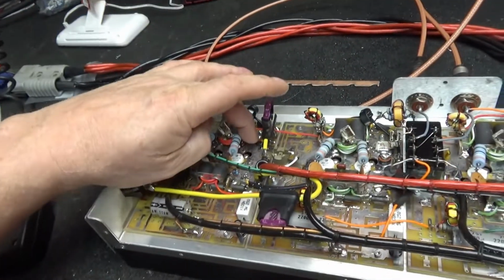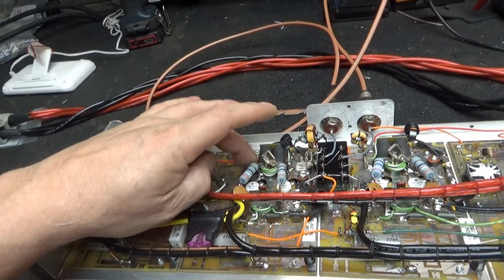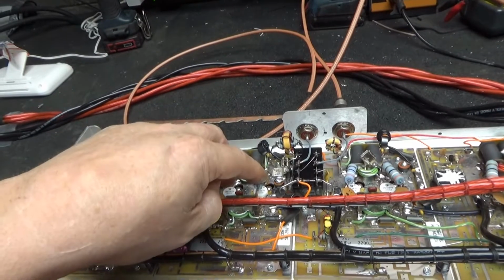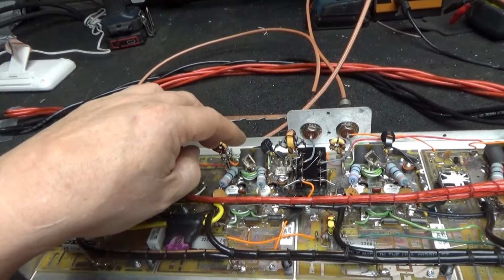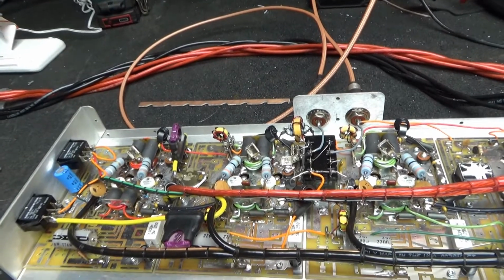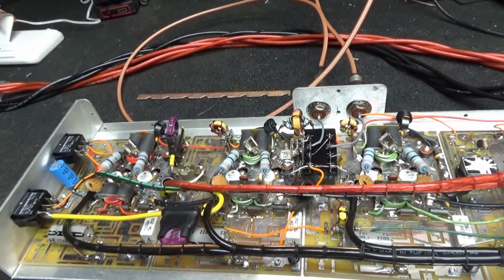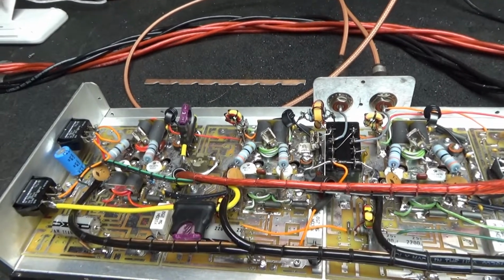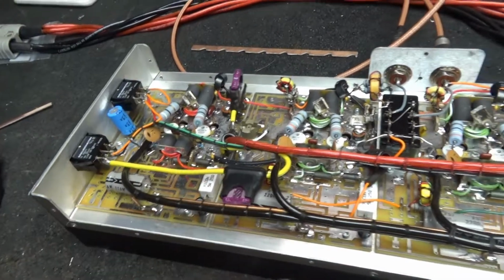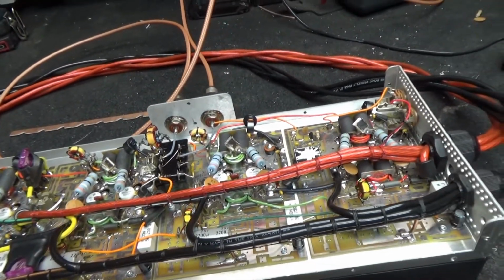I changed out the I think this one didn't come with, I think he took these two transistors out of it because it blew them, I guess. And these had old transistors in it, best of my memory. They were HGs too, but they were real old, 13 something. These are 16 D08s. New 10 ohms. Done what I was supposed to do to it, I guess.